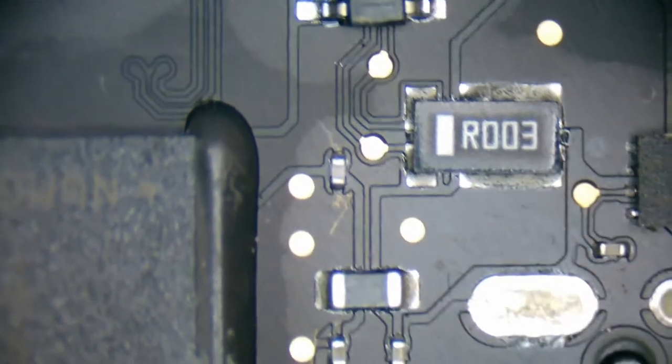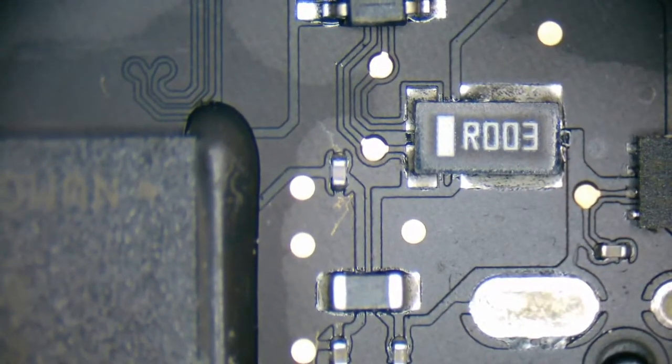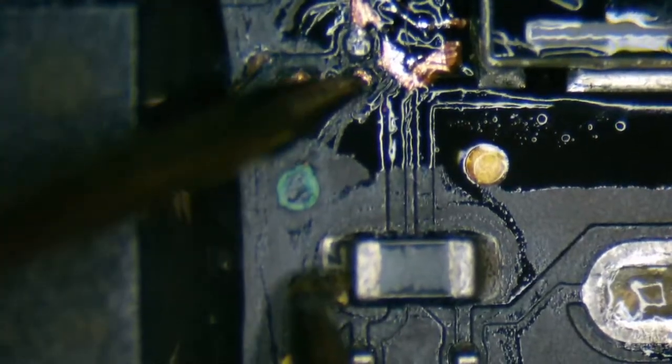So back to our microscope camera. Actually, before I do that, let me check my trace, because I think I did have a severed line. Let's check the continuity between that bottom pin where the capacitor goes to and this coil. Okay, it's still there. Just wanted to make sure that way I didn't have to run or etch any further into the board itself to expose the trace. So,